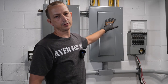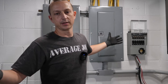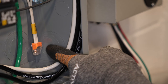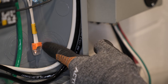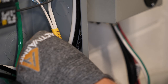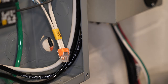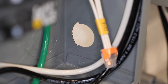Now this is mounted to the wall. Next thing we're going to do is take off the cover to the circuit breaker panel. First thing you want to do, obviously, is shut off the power so you don't electrocute yourself. Next thing we're going to be doing is punching out one of the knockouts — the one that you had previously lined up with the transfer switch. If you're going into the multi-sized hole like I am, the center one goes in and then the small ring after that punches out. Just take a screwdriver and pop it in. Now I need three-quarter inch, so I'm popping out the next ring. We'll take some needle nose pliers and bend those closer together. Now we have our three-quarter inch hole.